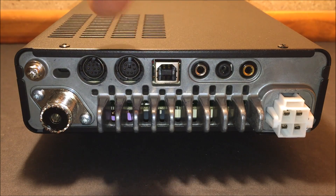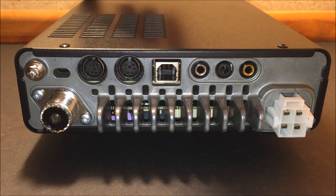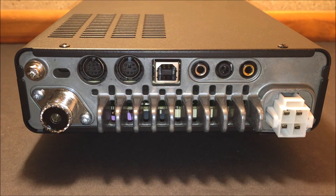The ports in the back are for additional optional accessories, such as the new FC-50 automatic antenna tuner — a 100-memory microprocessor-controlled antenna tuner specifically designed for the 891. Similar to an MFJ or LDG tuner, it automatically remembers your tuning preferences and is instant when you go back and forth across the band. It's about the same size as the radio, so it stacks with it really nicely.